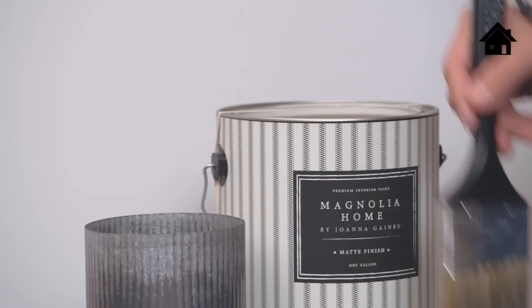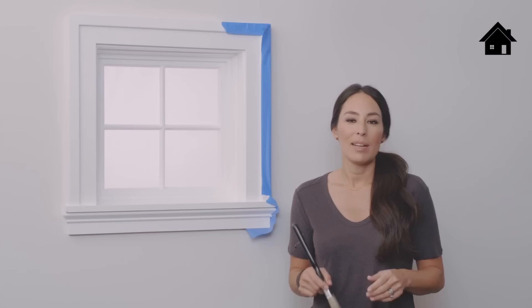To make your paint job look more professional, I'll show you how to trim out around the edges and borders where the roller can't fit — pros call this cutting in. You want to start with your 2-inch angled sash brush. Before painting, condition the brush by dipping it in some water and shaking the water off. This makes the paint come off the brush easier and makes final cleanup a lot simpler.